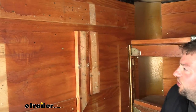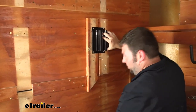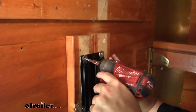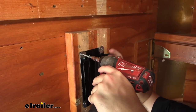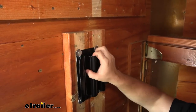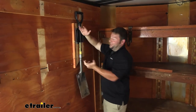If you look behind me, we went ahead and put two 2x4s next to each other so it sat out from the wall — because if you were to put it right against the wall, the shovel would kind of be against it. This lifts it just a little bit so the shovel can sit in there easily. I'm just going to run a wood screw in the pre-drilled hole. It's a little bigger than normal, so I attached a washer or two — that way it takes out that extra space. If you were going into metal, I would use a self-tapper instead. Just going to run it down and add the rest. With it installed, we're ready to add our shovel. Easy install.